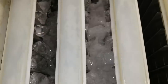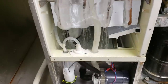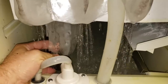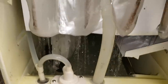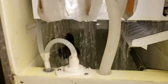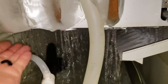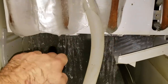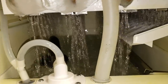We're running hot water through it, letting the water pump push it up into the spray rails and letting the water drip down over the ice naturally. Another tip — if you can, pull out your cube guide so the ice doesn't drop down onto it. If you do pull the cube guide, be careful because that ice comes down with a vengeance and will bust everything in here. Melt it slow and use your hand to hold it up. When you have freeze-ups this bad, you're probably going to have a busted cube guide.